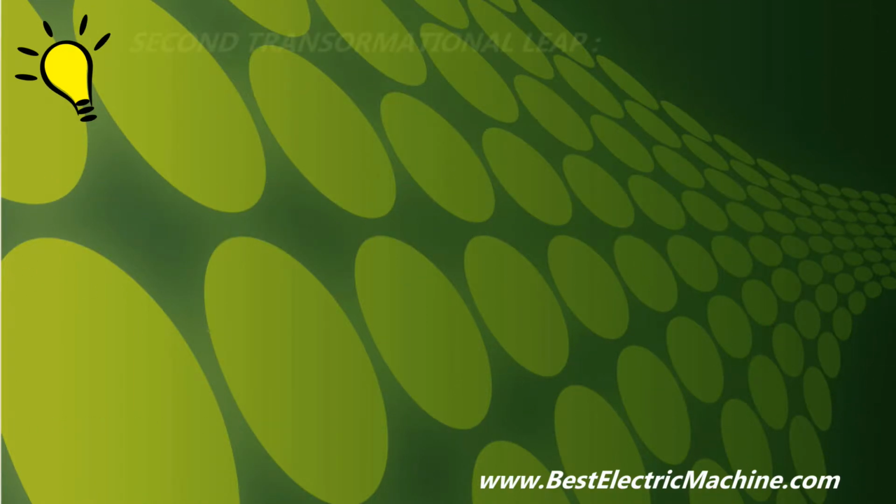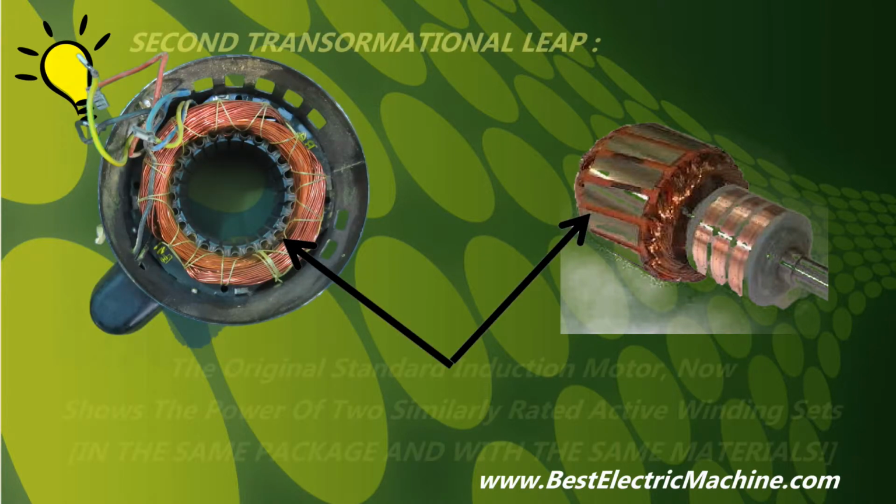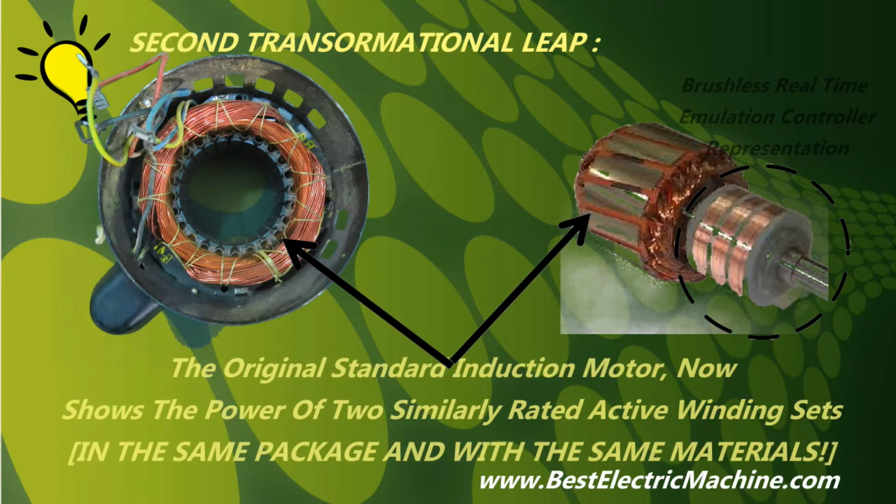Second transformational leap, the new retrofitted electric motor system collectively shows the power of two active winding sets on the rotor and stator, respectively, or twice the rated power, in the same package as the original standard induction electric motor, but also with the same materials, the same cost of materials, the same electrical loss, and the same thermal dissipation as the original standard induction electric motor, or system. Note, if considering the retrofit of a permanent magnet electric machine, the additional extravagant cost and real estate associated with cartel-controlled rare earth permanent magnets are conveniently eliminated, thereby leaving only relatively inexpensive copper and electrical steel as the remaining materials to consider.